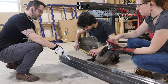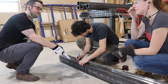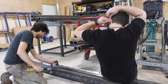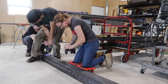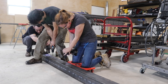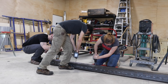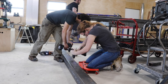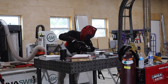This is Matt's design and he's already built one before, so he is very much the foreman of the group — divvying up tasks and making sure we weren't messing them up. Johnny, me, and Cremona started working on the saw head beam. We needed to transfer drill and tap a bunch of holes that will later attach a linear rail. I went first with a small bit, Matt followed to enlarge the hole, and then Johnny tapped them.